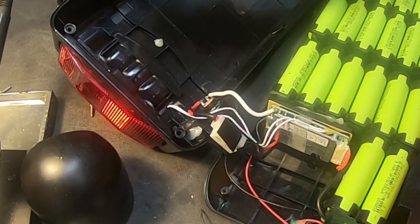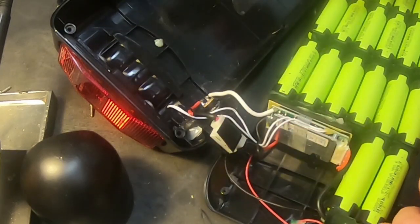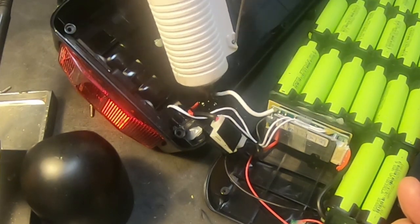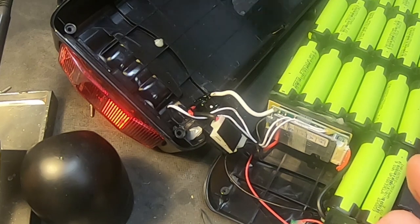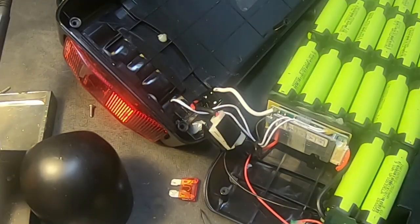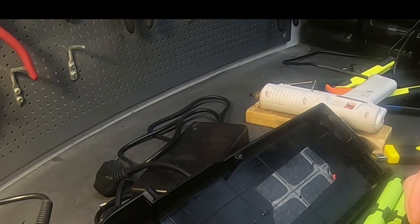It's actually quite good to add a good amount of silicone, but you want to be careful not to touch both the positive and the negative pole if you haven't removed the fuse. Then you add a lot of silicone — just to make it a problem for the next guy who has to repair this. The fuse: 10 amps is too much; it's a 2-amp charger, so a 5-amp fuse will be fine.